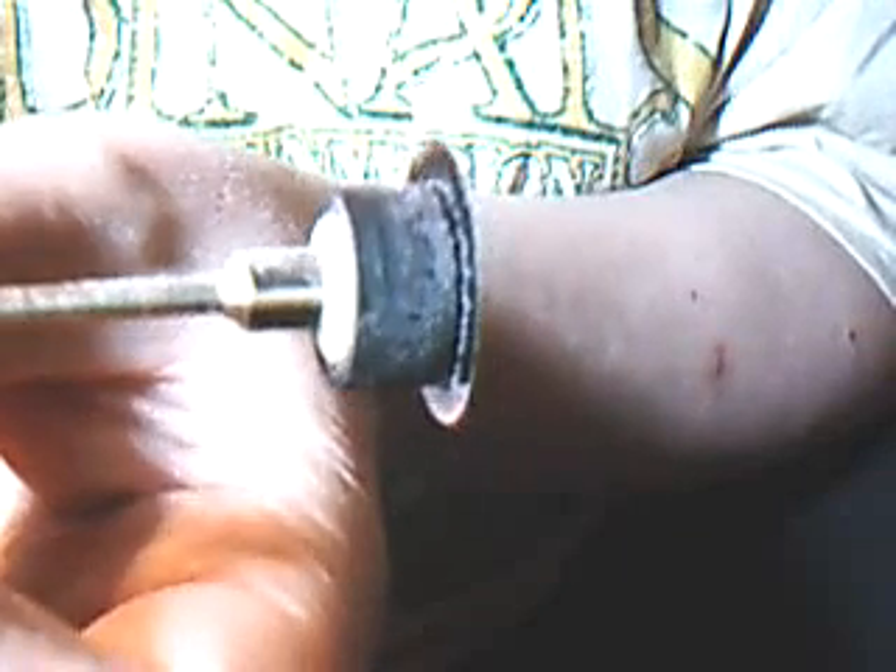There we go — I've got a little mini circular saw with a rubber wheel on it, and the rubber wheel stops me from cutting too deep, so it makes sure there are no nasty accidents. Now here's my box. I put my rubber wheel up against the box and get it in the right position. The wheel actually goes a little bit further — just a fraction, about a millimeter of overhang. Now you would say, 'That's going to cut your battery,' but actually no, because the batteries are round. Looking along the lip, you'll notice the batteries are round, so the actual cutting blade doesn't actually touch the batteries.